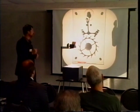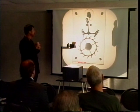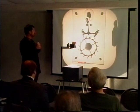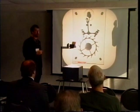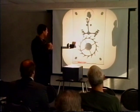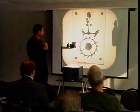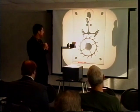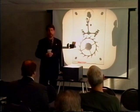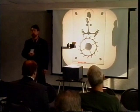And then also, but then what happened is that the unlocking portion, this lever arm, is quite a bit longer than this one. So this one here would unlock easier than what this one did. So then they came up with a compromise. They came up with a semi-equidistant where they took about the first quarter of the impulse surface of each stone and put those equidistant from the pallet center, and that's kind of where they've settled. They've taken a compromise of the two.